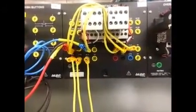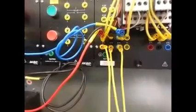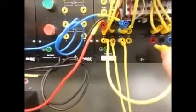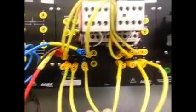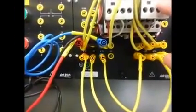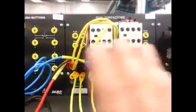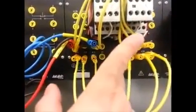I'm using the yellow cable because they're very short and don't cause a big mess when you're all done. I've plugged in T1, 2, and 3 from one side of the contactor, and I'm going to do the same and match up T1, 2, and 3 on the other side. When this contactor is turned on, power will come out and go to the overload. When this contactor comes on, power will come out and go to the overload as well. So basically you're making a parallel connection — determining which one comes on will send power to your overload.